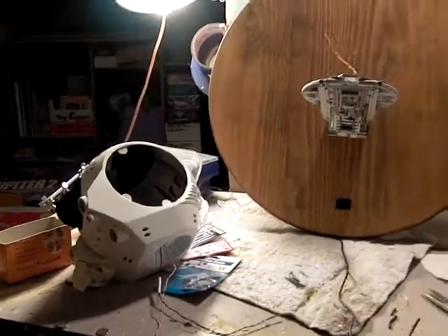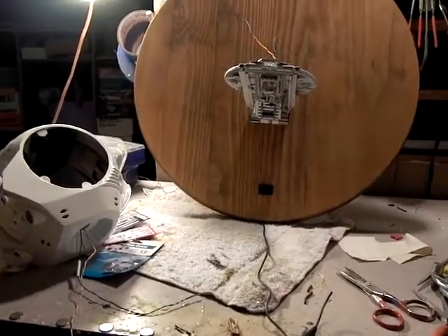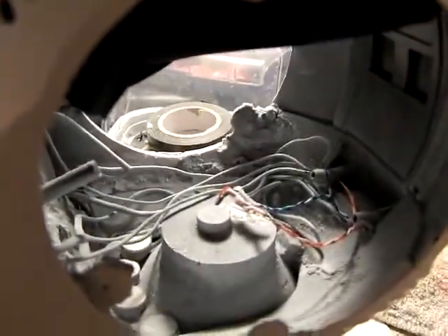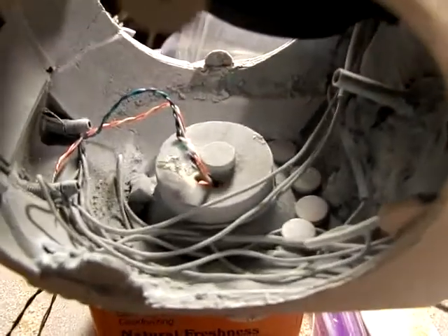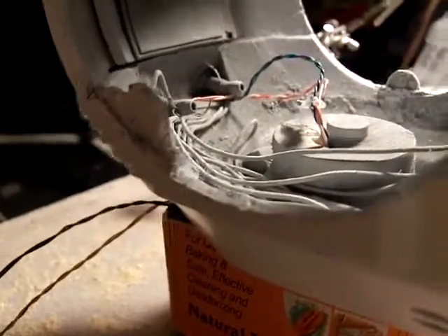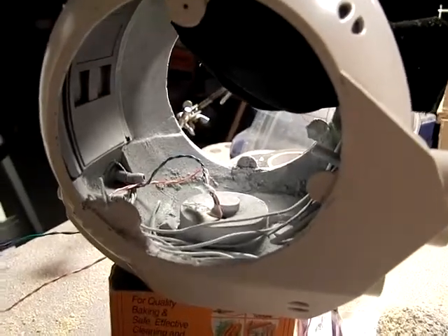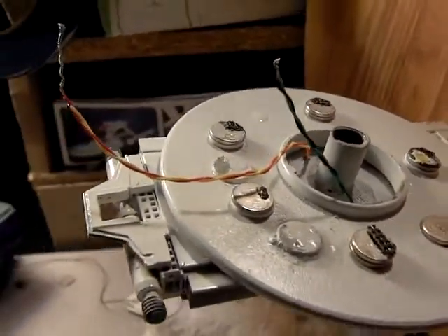I did a lot of cutting on the backside and all that is basically gone to history at this point. The switch works. I didn't wire the pot up yet because I still got to put decals on that. I drilled that hole straight through the body and wired up the back connectors into the main bus, so I can still power it through the backside or through the bottom. There's a little excess length in here that I can pull out for when rotating the pod on the base — that excess slack will avoid any pinching on the wires.